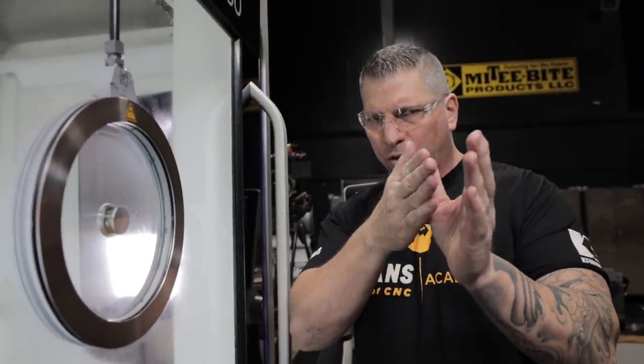All right, there you go, tangential milling. It makes sense, right? Instead of the insert being this way and thin, the insert's this way, and you got a lot of carbide behind it, and it gets after it.